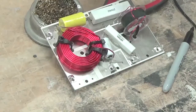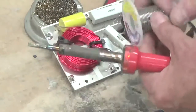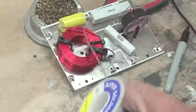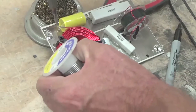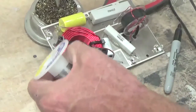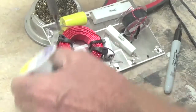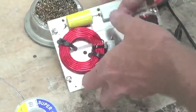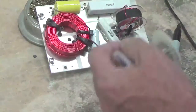We're going to solder this. It's a typical 25 to 40 watt soldering iron and I run it as hot as it will go because I like to solder quickly. When you have two wires in one hole, sometimes the solder will wick down below the hole and not make the joint. So heat it up a little, apply some solder to tack things in place, then turn it over and see what happened — all the solder ran down the wire. Go ahead and clip that one; now it will solder up just fine.